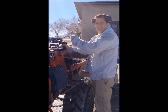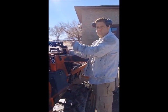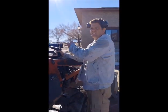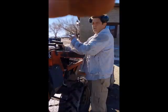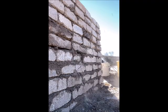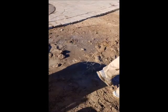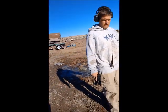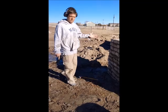Now, same three guns, same distance — 40 feet. This is a Glock 40. This is also a 14-inch thick wall but it's unstabilized — no cement, just 100% dirt blocks. Let's see what happens. This confirms what I was saying — same size earth block, same distance, same gun — it went in the same distance, inch and a half, which is what it did for the 8% cement-stabilized block. So again, just to confirm: the cement doesn't really make the block stronger. It actually just makes it waterproof — 8% cement makes it 100% waterproof, and that's why we put it in there.